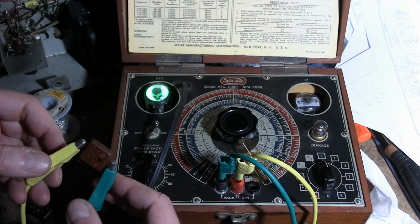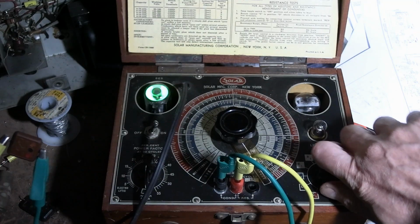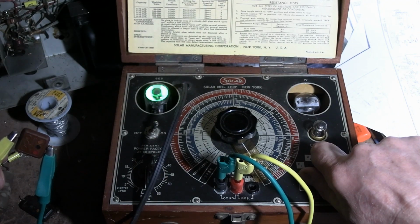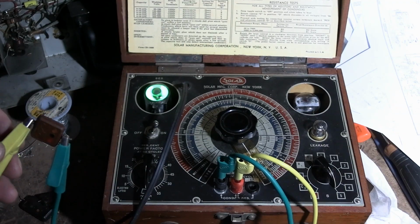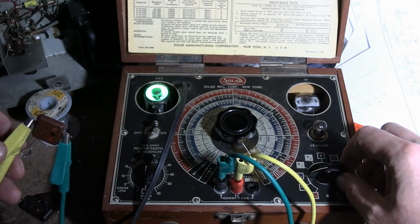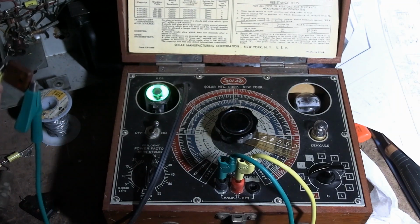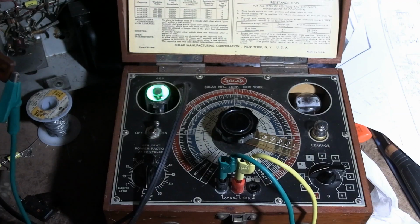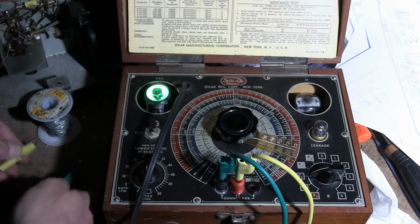We won't really know for sure unless we busted it open. Let's see, this might actually be okay. Let's check. Alright, so it's not leaky. What about the capacitance? Okay, it's not showing short when I'm testing for capacitance. And let's see, C3 range. Yeah, that actually tests good, so I could have left that in. I already took it out, so I could tack it back in.